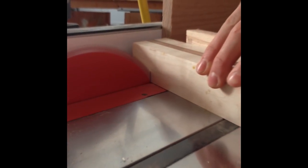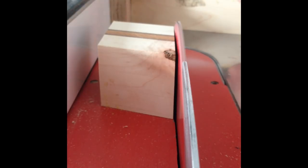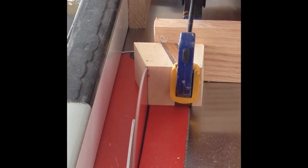I can make the first cut to start on what will become the chevron pattern. This first cut changes the shape of this piece from a rhombus to a square. You can see that the piece that got cut off kicks back a lot and sometimes gets stuck. So I just took it nice and slow, making sure to use a clamp every time I could to save my fingers from getting close to the blade.